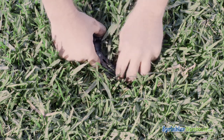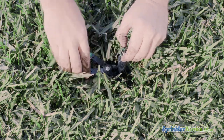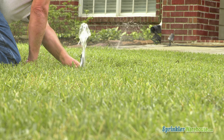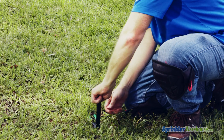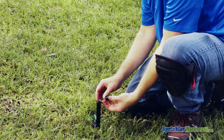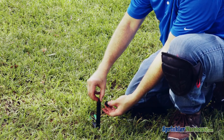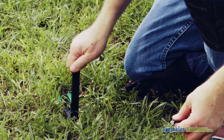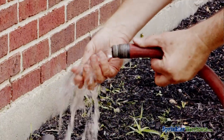I'm going to use a pull-up tool to hold up the stem. We sell these on sprinklerwarehouse.com — there are a couple of different brands. If you don't have one, you'll have to hold up the stem by hand, and it'll help to have an assistant. Unscrew the nozzle. There should be a filter in there as well. You can see if there's anything clogging up the filter or the nozzle and clean it off if that's the case.